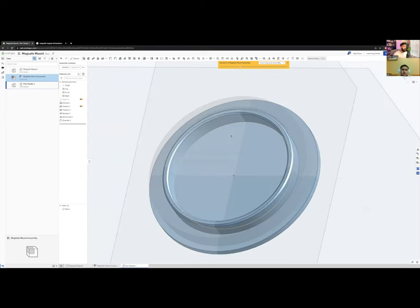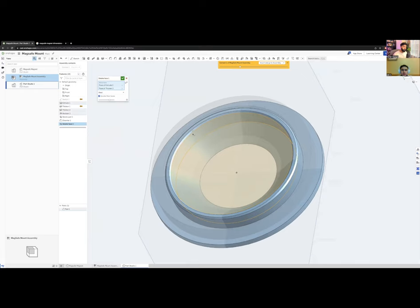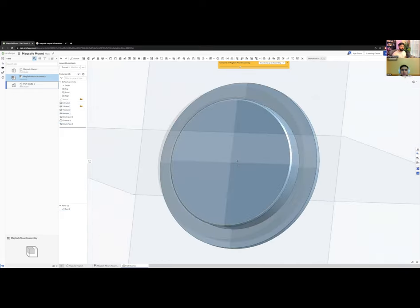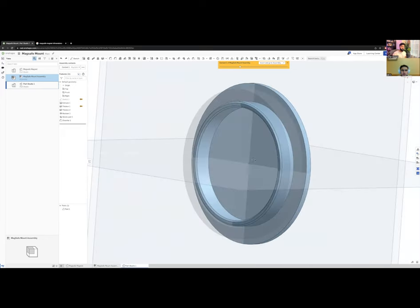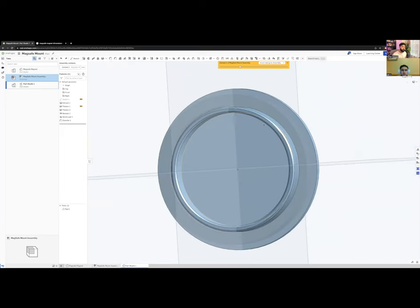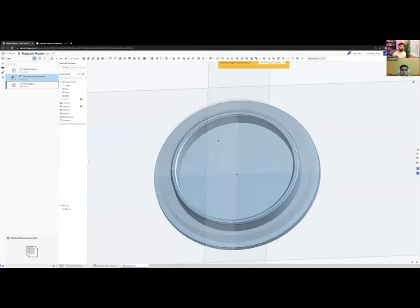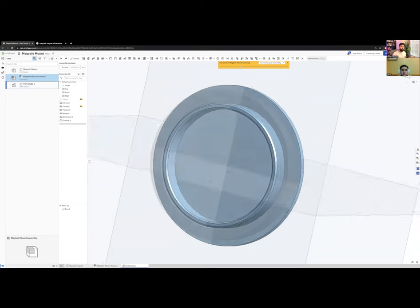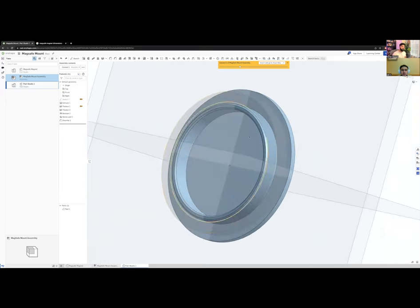You could also delete the inner interface entirely. If you were injection molding this part, you'd want uniform wall thickness — we'll discuss that later. For now I just want minimal material and no excessive weight, so I made it hollow. That's why we have a hollow inner chamber with the ring sitting nicely on it.